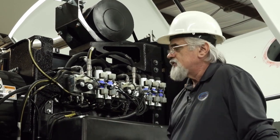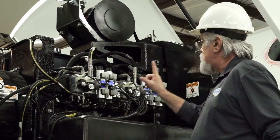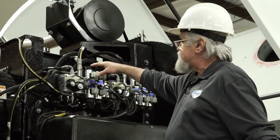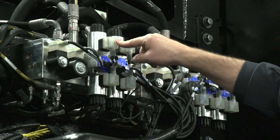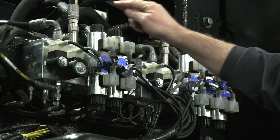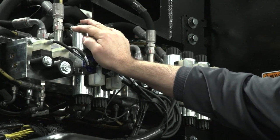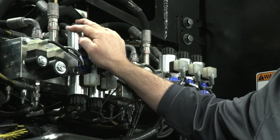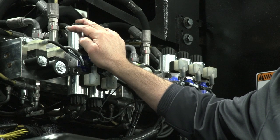Most of the time, however, the issue is actually going to be the lock valve, whether that is on the left broom or on the right broom. The directional valve has two DIN connectors that power up either one of those coils and open the valve one direction or the other. If those coils are bad, that valve is not going to open.